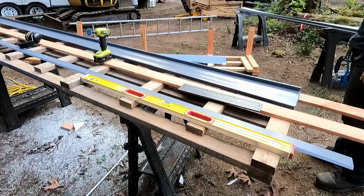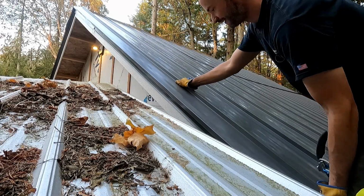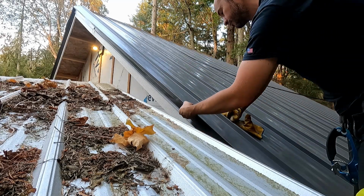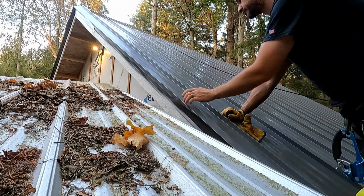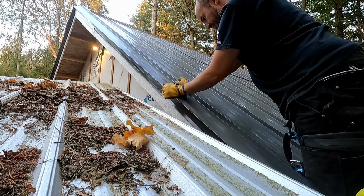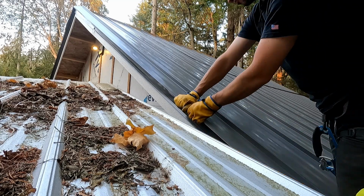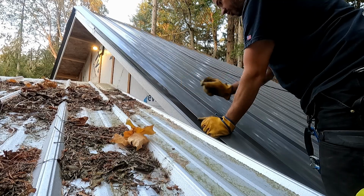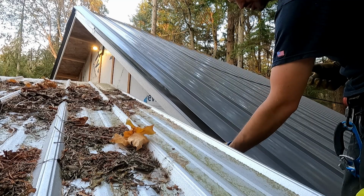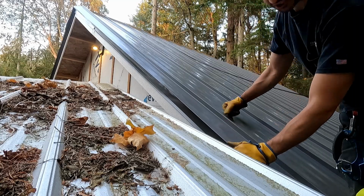Last piece is made. God willing, it fits. This bend can only be bent to 90 degrees on the ground, otherwise the panel won't go in. And then you can just hand bend it most of the way, it's 180. Then what I'm going to come back and do, all along the eave and up this rake, and I already did the previous rake, is take two soft-faced hammers, a heavier one braced underneath and a lighter one on top, to pinch this seam tight. Right now we're just getting it in place.